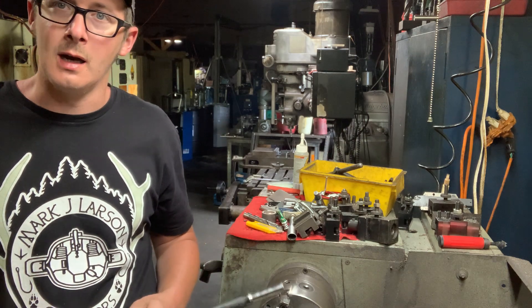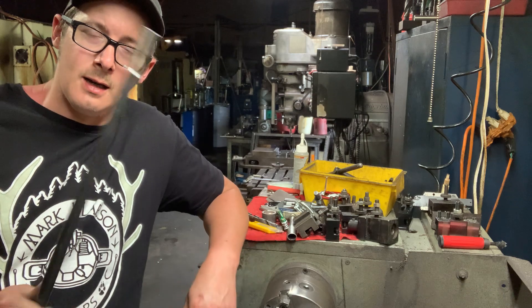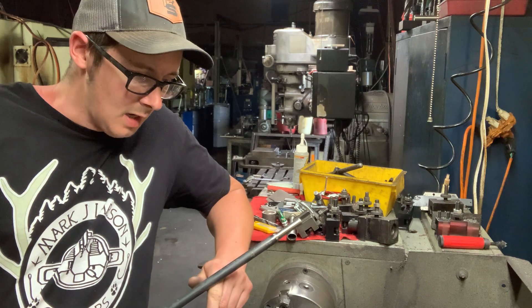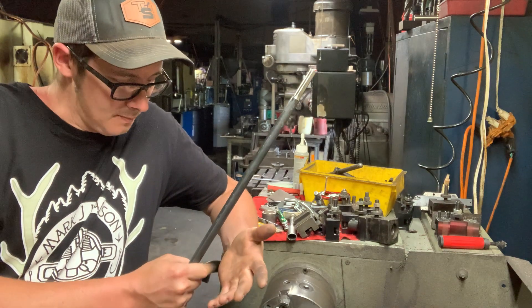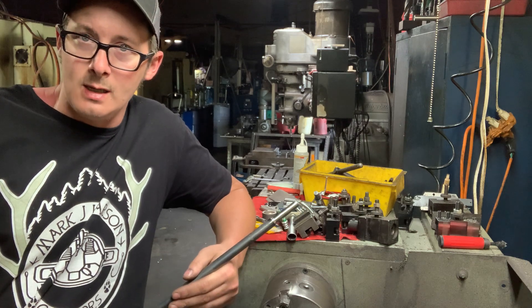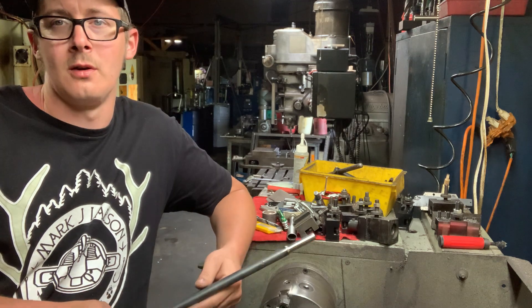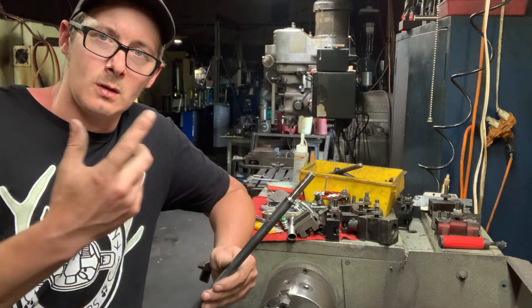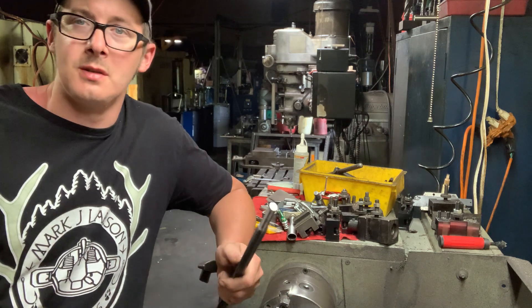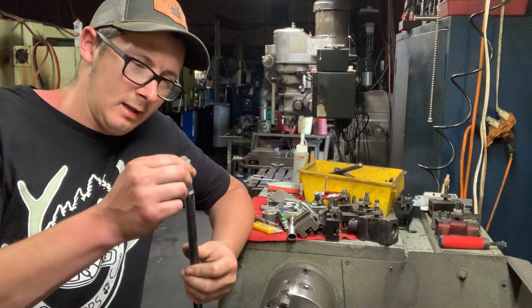That's doing it manually. You get rather spoiled doing it in the CNC — saw that took a few minutes here, but it takes about 15 seconds in the CNC to do it. I could use a different cutter and take more off each pass, just change my spindle speed, but I'm in no big hurry today. I'd rather enjoy sitting back here and taking my time doing it.